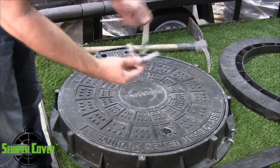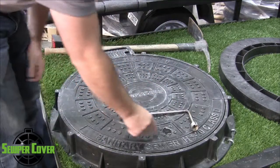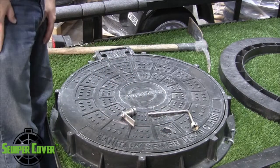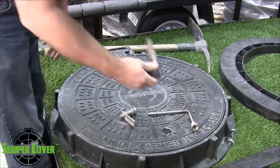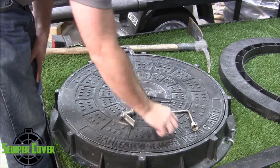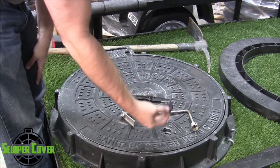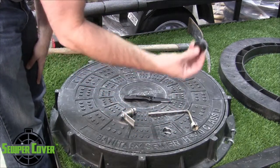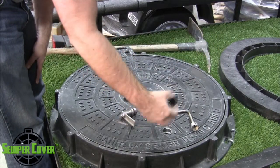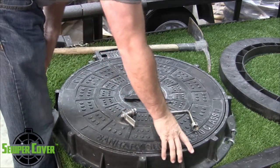So we're going to go through the motions to show you how to properly do that. There's a rubber bung with every single unit. To remove the rubber bung, you can use a screwdriver, a pocket knife, pretty much anything a guy out in the field is going to have. This helps eliminate even more I&I infiltration that gets into the sewer system, so even this little tiny rubber plug actually saves you a lot in infiltration of storm water. It merely just goes back in its hole any time you're done.